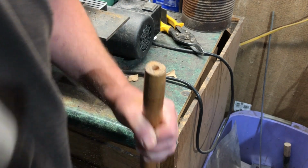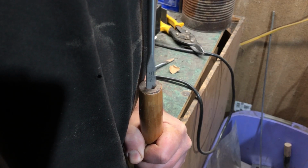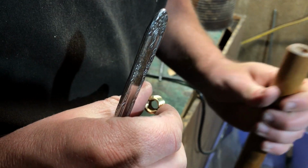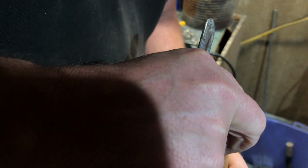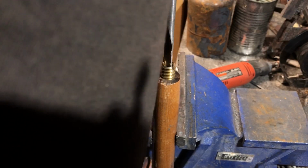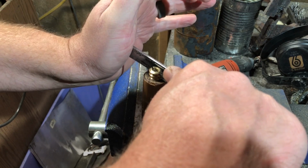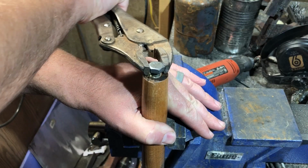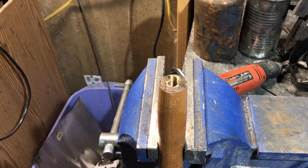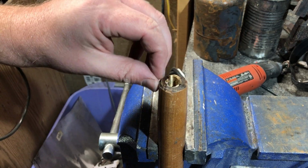As it stands, I had to go a little wider than I wanted to when pre-drilling the hole for the insert. And that meant that the lockup between the threads on the outside of the insert and the wood was maybe not quite as strong as it would be with one designed for hardwood. But after a little trial and error, I managed to get this threaded in there. A little portion at the top broke off, but it was only maybe 1/8 inch to 1/4 inch of the threads, so not enough to really get concerned about.